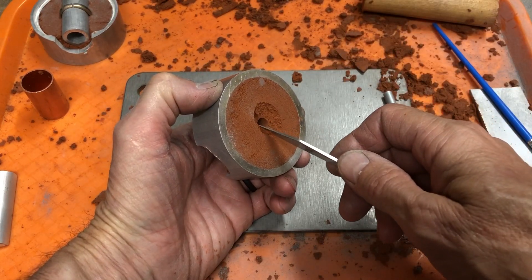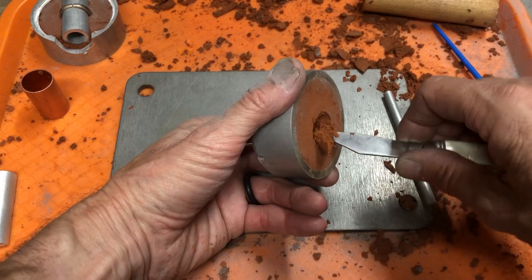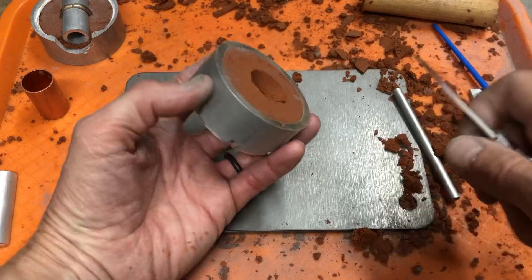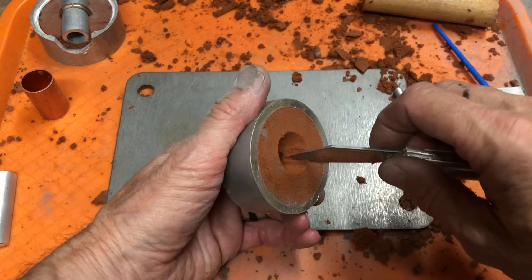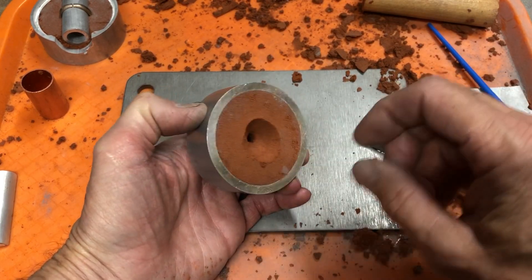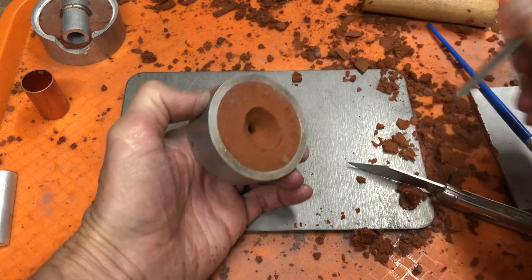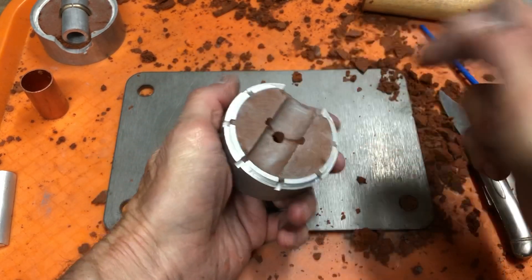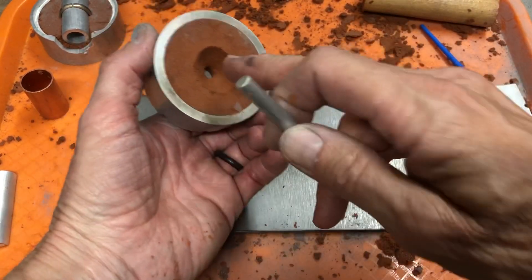Take your knife and cut around — we're gonna create our sprue hole, or our funnel. This is where the metal is going to get poured. You don't want to go all the way through but you want it deep so the metal goes right to the hole. Sometimes people make them too much like a sink bowl and the metal spins around, causes turbulence, and you don't get as good a casting. So turbulence — you don't want that. Push it that way, just let it drop through — that kind of cleans it up and makes it nice and smooth.